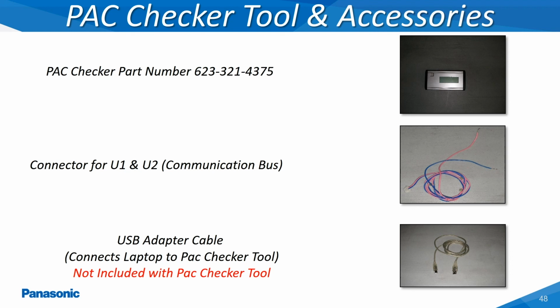Some of these items are low refrigerant charge, stuck valve positions, low compressor oil levels, identify indoor units operating in the freeze prevention mode, delta T across the evaporator coil, evaporator superheats of the indoor units, initiate a test run mode, see any pre-trips or current alarm conditions, and for logging data which can be saved to a PC or laptop.